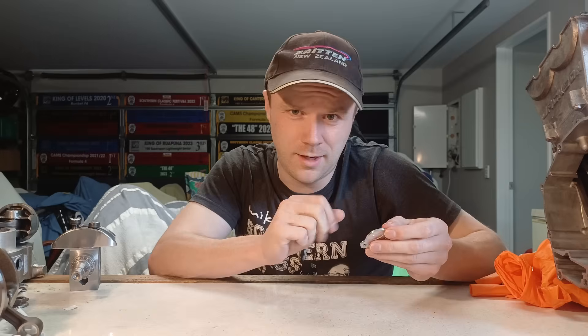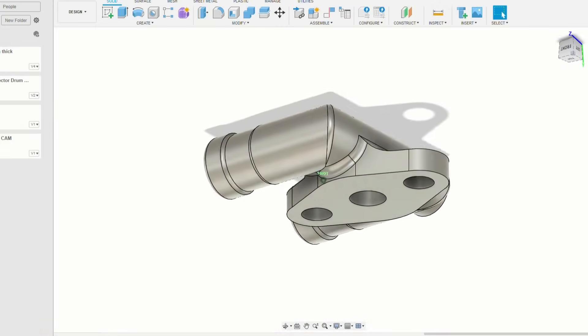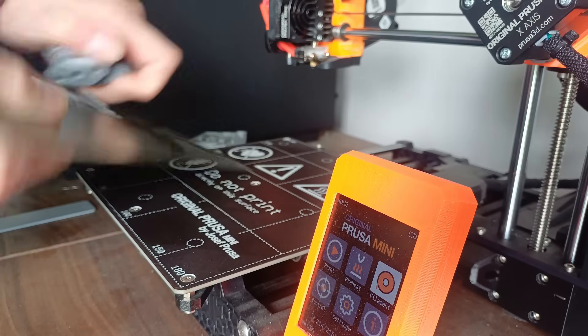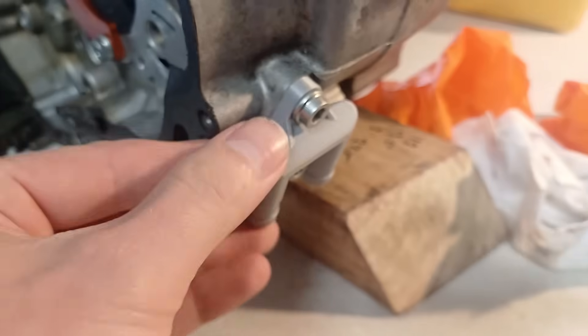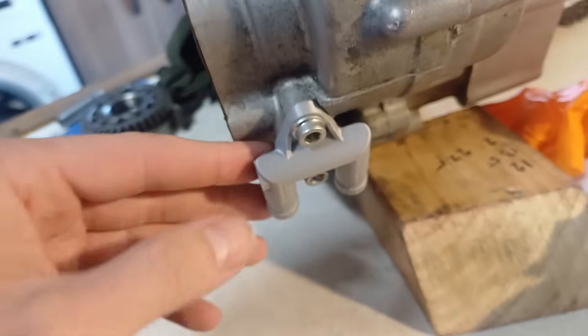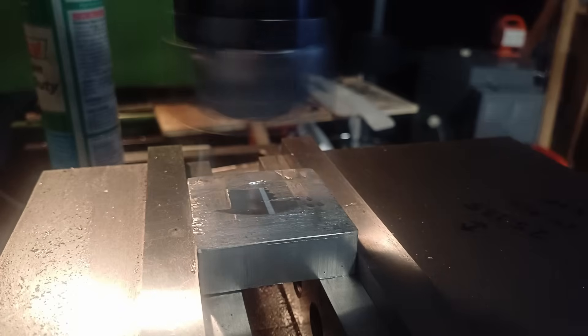So I'm going to have a go at making something a bit more complicated now that I've cut my teeth on this. What I'm going to make is an oil junction which bolts onto the crankcase and splits my oil line into two — one line to the cooler, one line to the oil pressure relief valve. I'm going to do a quick test fit with a 3D print first because it's an awful lot of energy to put into something that doesn't fit. That's told me I can actually make it a little bit shorter too, since I have plenty of clearance, so let's go make it on the desktop CNC.